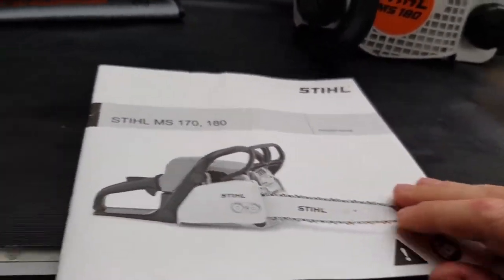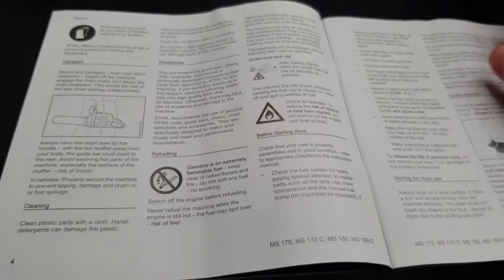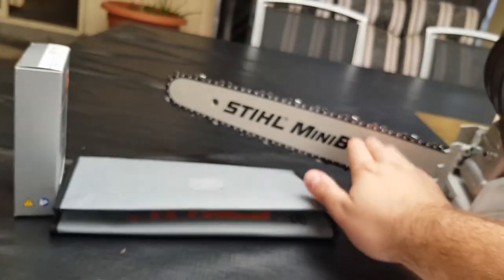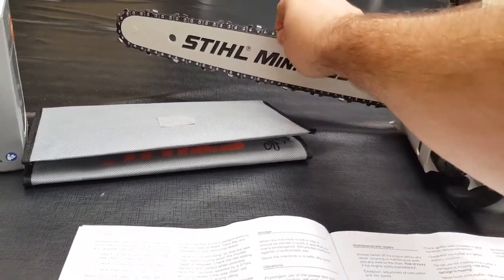So I'm going to have a look through this book here just quickly, go through the pages, just because it explains what things mean. A lot of safety stuff - go chainsaw backwards, leave the brake on, starting it on the ground, wear your gloves - all sorts of things here. Storing it: drain everything from it. When you use the chainsaw and you want to put it away, just loosen the chain, because when it's hot it will shrink back down and can damage the saw.